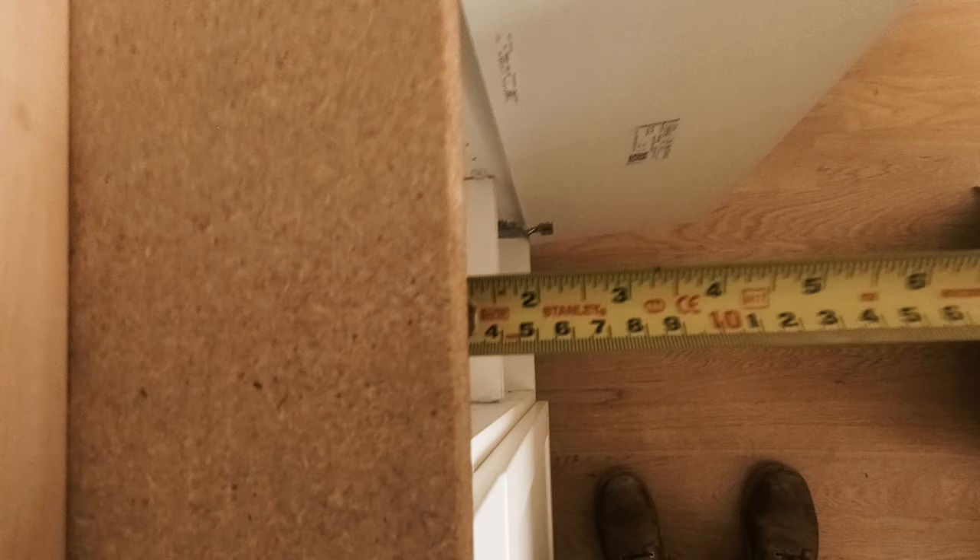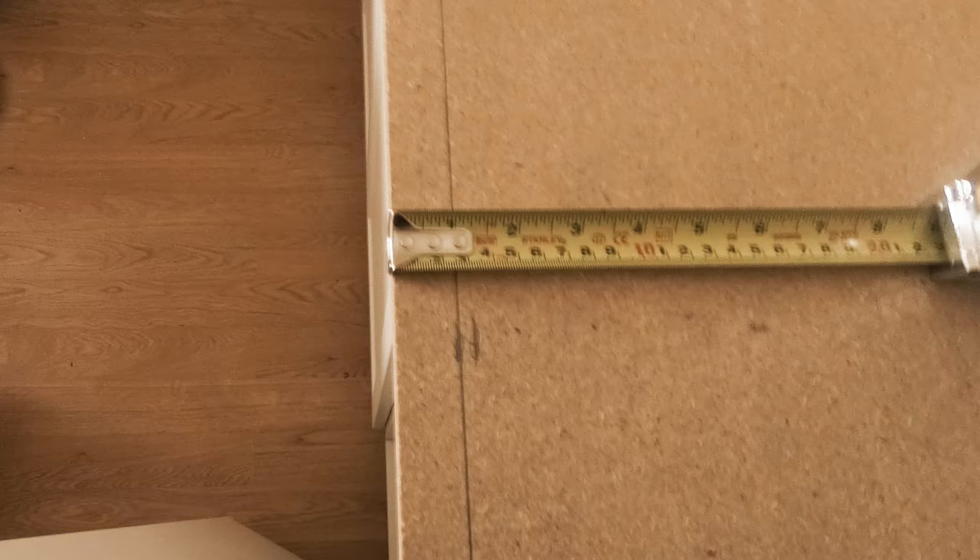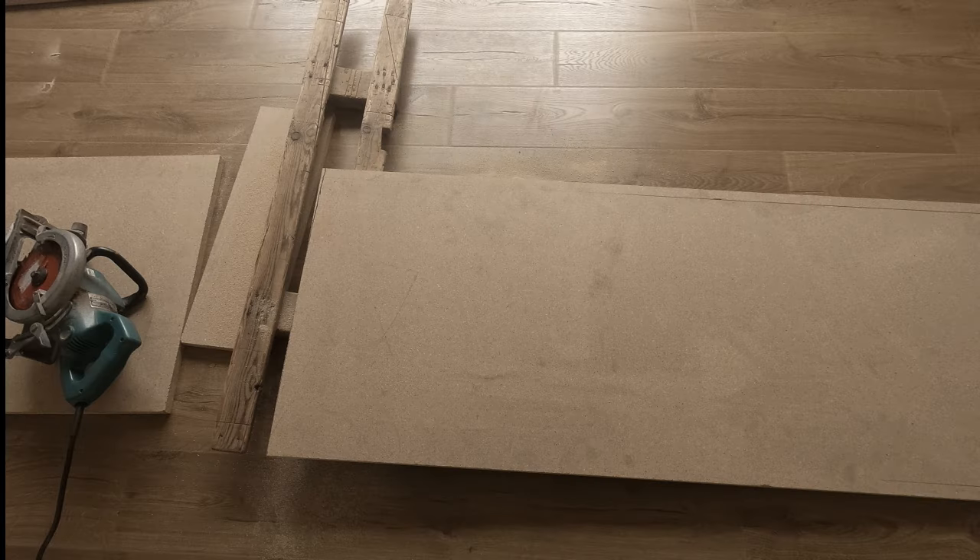The 1x2 is the same thickness as the doors and drawers. I want the finished edge to stick out past the drawers so that any spills won't run down into them. With an inch and a quarter of overhang, if we trim one inch off the back wall, that will give us a quarter inch overhang to mount the 1x2, which will give us the proper finished depth. I'll mark it along the back edge for my actual cut, using my handy 1x2 as a straight edge. Then take it back to my cut station to trim both walls. By trimming the end wall, it brings the open end back to where I want it.